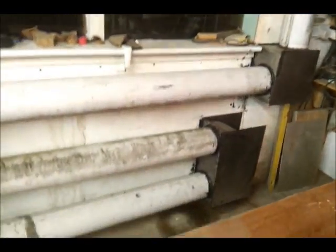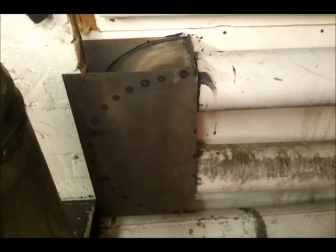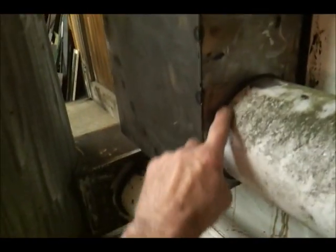The reason for these weird bendy contraptions is I got this pipe off a mate - it's actually six and a half inch pipe and I couldn't get bends for it. So I figured if I'm going to buy six inch bends I'd have to make some kind of adapter, and it would probably be easier to just build these boxes to take the pipe. I got two steel plates and welded a semicircular plate around, then welded a flat plate on the front and cut two holes in it.